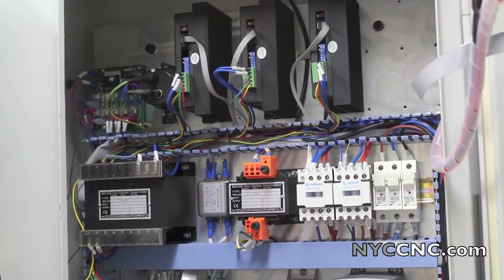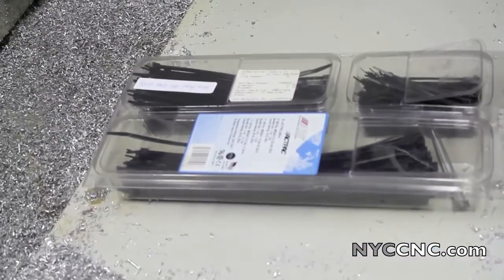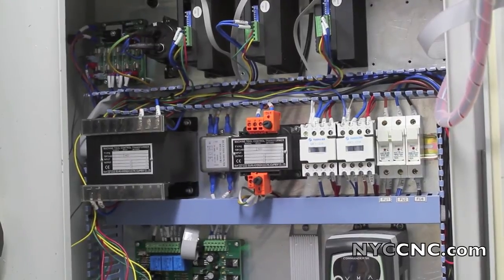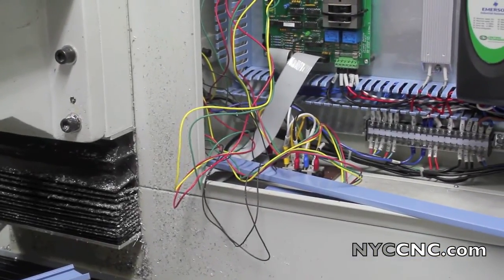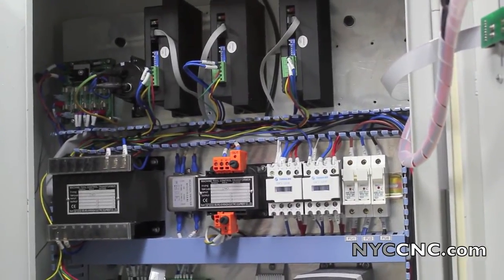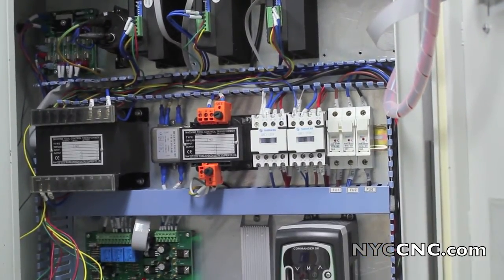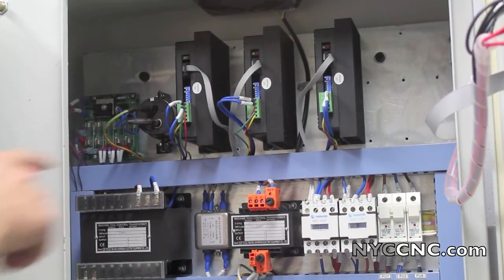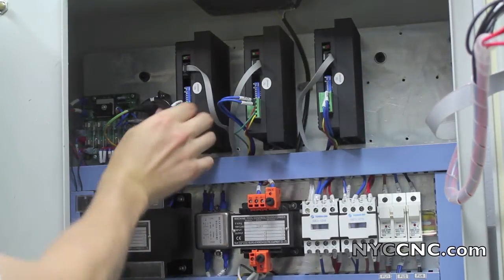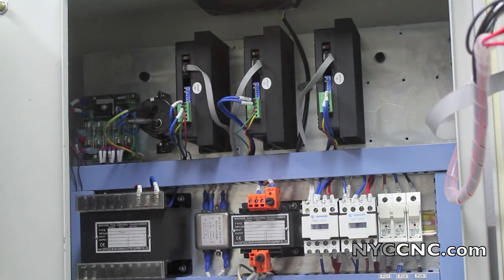If you can get all those wires back in the conduit runner without any trouble, you're a better man than I. I used a bunch of little zip ties to keep it neat, and it actually didn't take that long once I had them in. I'll zip tie the rest and tuck a lot of it back into the Z-axis column. Check polarity on the two blue wires for each driver, give a quick tug on the red, green, and yellow to make sure they're seated. Make sure the dip switches are in the correct positions per the instruction manual, and make sure all terminal blocks are fully seated.